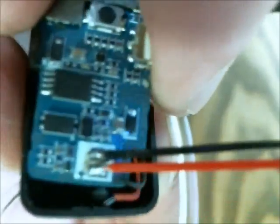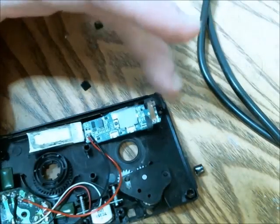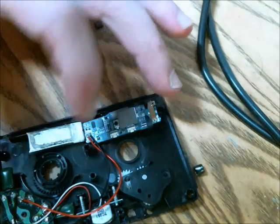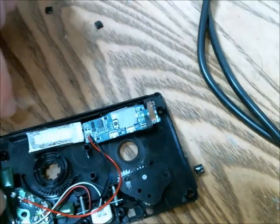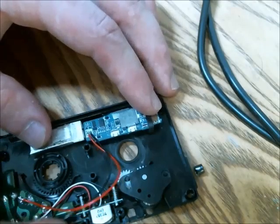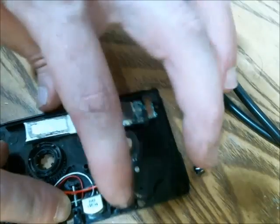The entire circuit board and battery will come out of the enclosure. Here's the cassette now — I've clipped out some pieces of plastic which were used as spacers, just so I could fit the Bluetooth module inside. I've connected right to right and ground to ground. Now let me cap this thing back together and see if it works.